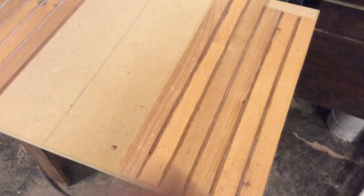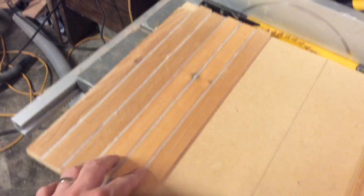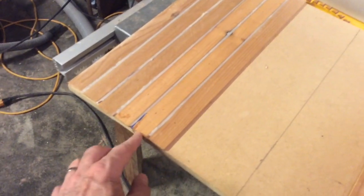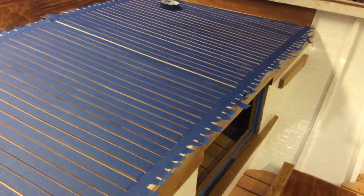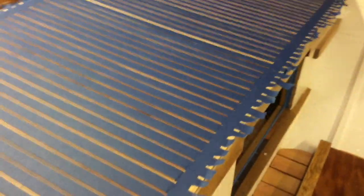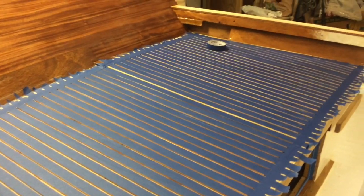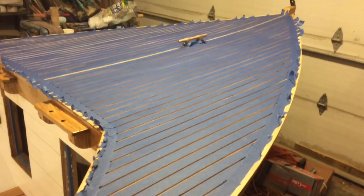What I came to figure out is why I did this — I taped these with the same blue tape, had them down tight and cut off on the edges. And you can see right there, I couldn't get the tape up, there was nothing to grab onto. Part of the reason I'm not going to do the edges initially is because I needed to leave some overhanging so I can just pretty easily grab on and lift those off. Based on everything I'm reading and watching on other YouTube videos, it appears it's a good idea to put the caulk down and then pull your tape while it's still wet. So that's my plan.